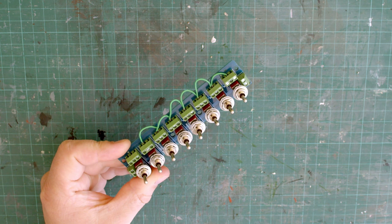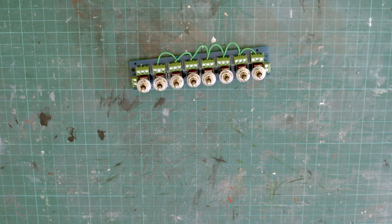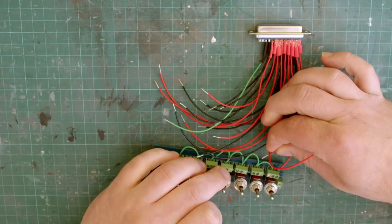I found this really handy bank of switches which comes on a PCB board. I'd had enough of soldering at this point, so thankfully to connect the wires to these switches I can just use the screw terminals at the back. If you're thinking about adding point motors to your own layout, I can highly recommend this. It's basically like having a mini lever frame from a signal box ready made up for you, and there are links in the description to where you can get these.